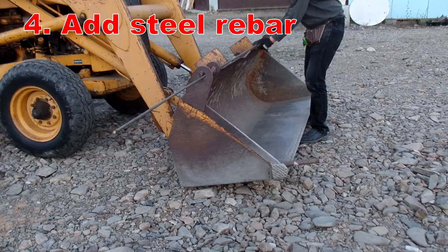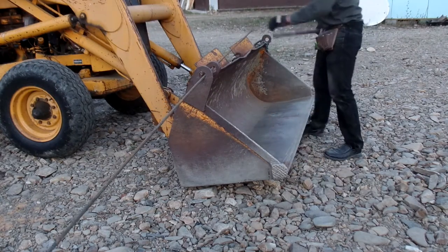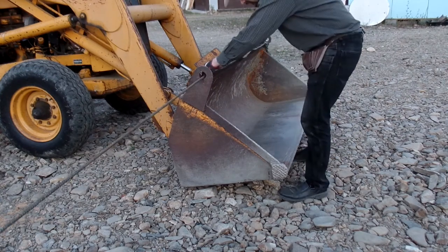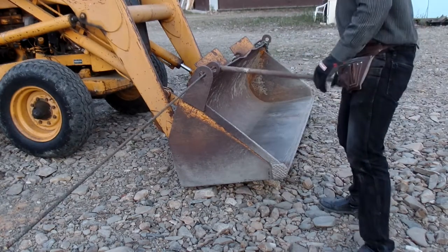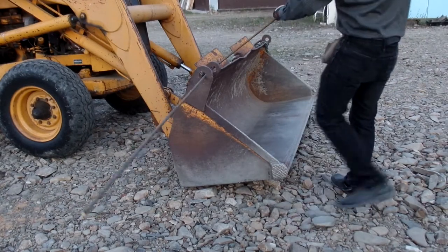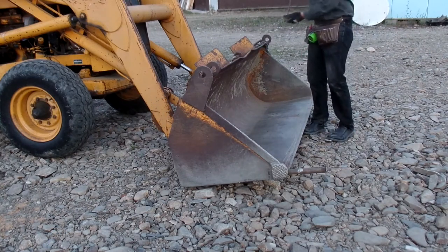Here's another fun trick: if you want to bend rebar around a corner, it's actually pretty straightforward. This is only half-inch rebar and it bends quite easily, really. But getting a clean sharp bend is actually really hard, unless you have some handy device that just will not move, and a chunk of pipe. The chunk of pipe actually keeps that bend from being this weird wobbly one-foot-wide mess — it's a super easy way to get rebar in there.